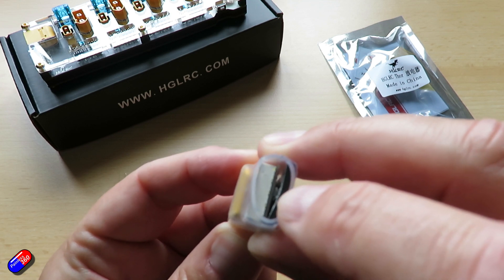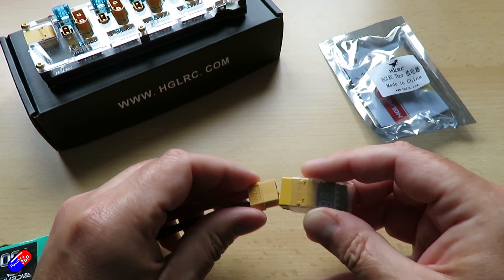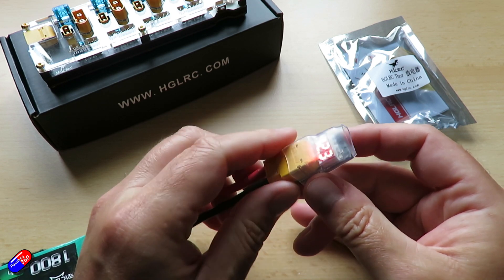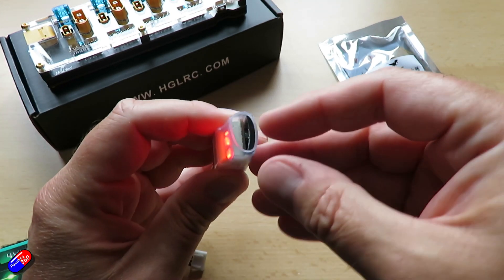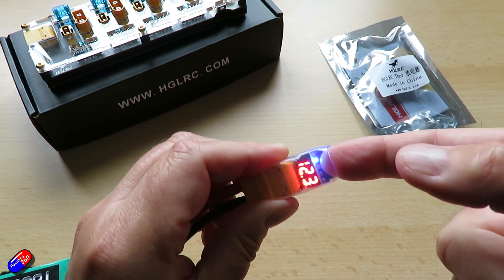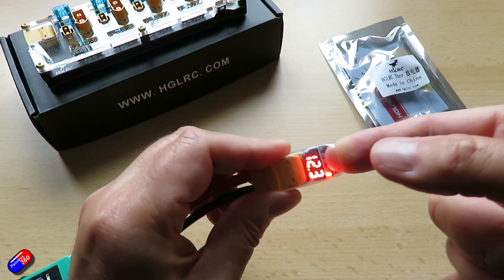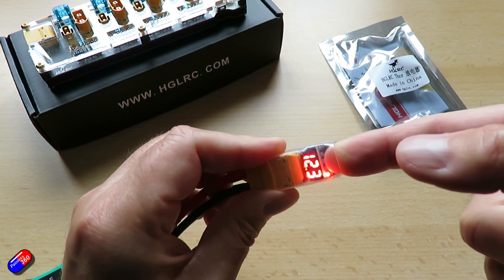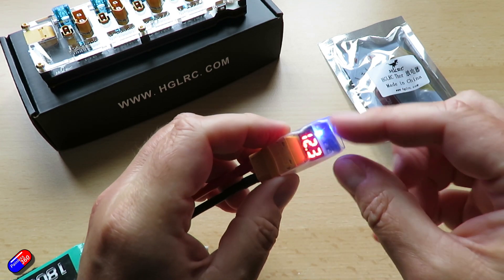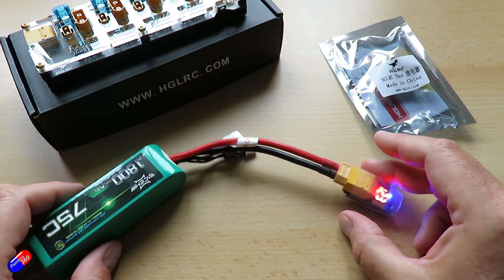There's only one kind of control on it — there's a little button in there. XT60 only, but you plug it in and it reads the voltage of the pack, which is actually very handy if you're just at the field and just want to see where everything's at. Then you press the button. A blue light is a 3S battery, and the green light is a 4S battery. You just set it to the level that you need. The button is kind of hidden away in the middle. So with a blue light indicating a 3S battery, it's going to sit there and discharge.